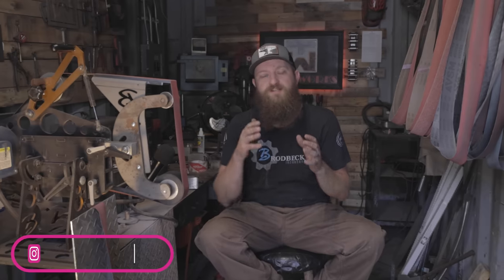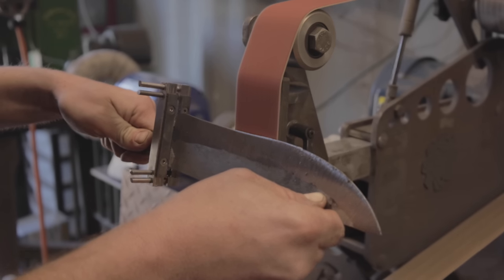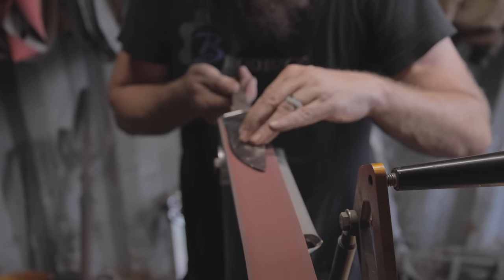What I didn't realize before I used one is that it's actually doing basically the same thing — it's just saving you a little time and adding a little bit more of a freehand grind experience. You're still going to be doing plenty of hand sanding to get a really nice knife, trust me. But instead of relying on a plunge guide or file guide to do your plunge line, you're going in and freehand grinding on top of the waterfall and creating a very slight radius instead of a really distinct notch. You have to do it by eye and by feel — the way I use it is all by hand — so it actually added a handmade nature to the plunge line of my knives immediately and it changed my mind right away.